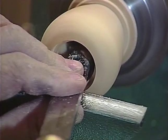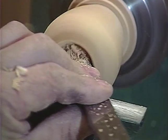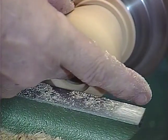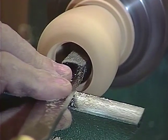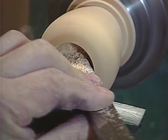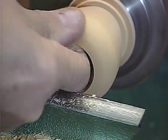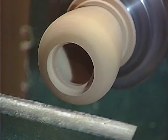Go down to the bottom of the box, then pivot slightly outward, taking that round. Get quite a bit of leverage when you're down that bottom end there. You can see the tool just bouncing a little, but it's pretty clean now. Just another cut, little pimple in the middle. I like to grind that slightly flat across the end so that I can go just over the other side of the center. When you're using these scrapers, you've got to be very careful that you don't damage the shoulder of the opening. I'm getting very close to that top surface at that time.